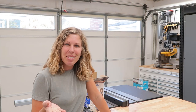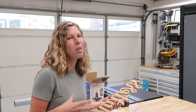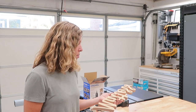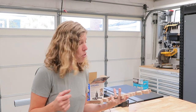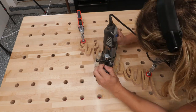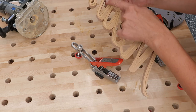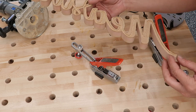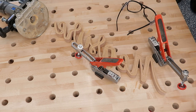I don't know why I'm so nervous about this next step — there are definitely some sketchy areas where it's really thin. But ultimately if I just take it slow, and if I'm feeling nervous I'll stop, take a breather, and reassess. Worst case I'll just have to cut another one. I've got my groove going all the way through. On the really fat parts I'll switch to the quarter inch bit. I'm only at about half the depth I need, so I'll give it one more run a little deeper before switching bits.